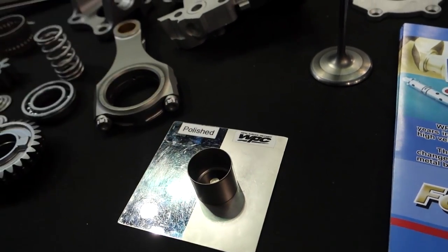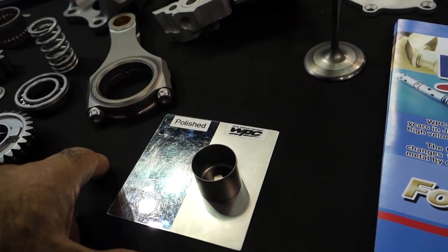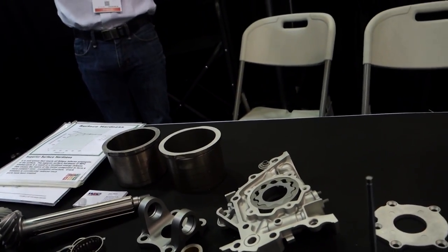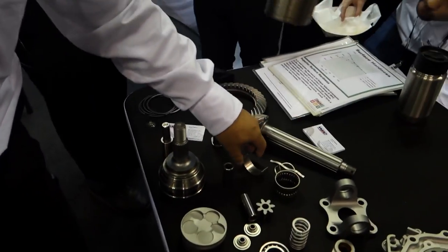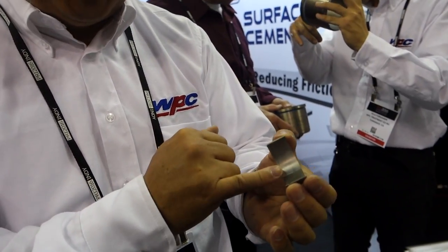Is this like a shot peening type of effect? Correct. Yes. But we are using a very fine media, like a powder, shot with high-speed gas. So this gear is done in the same process. Well, like titanium, a very hard material. Aluminum, kind of hard material. And for the bearings, very soft material, because there is a soft layer.